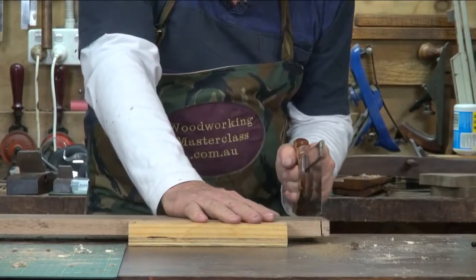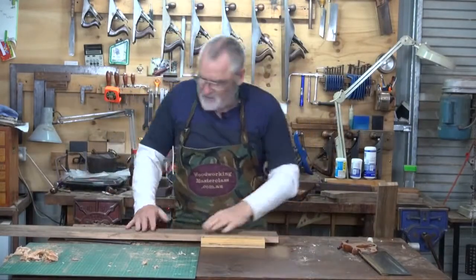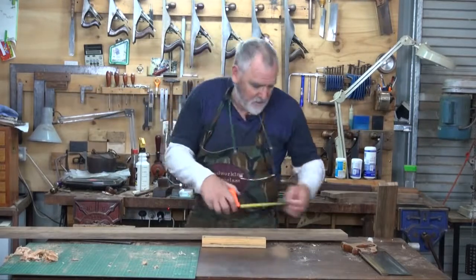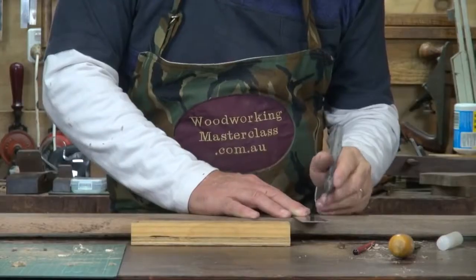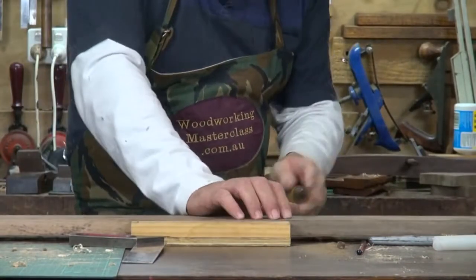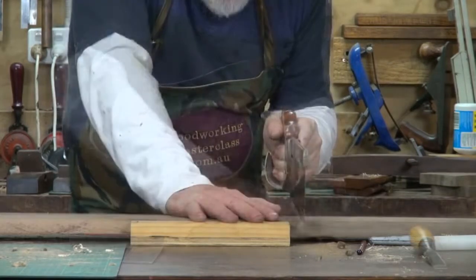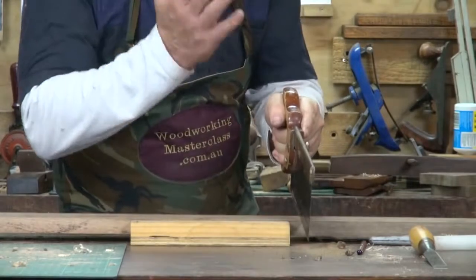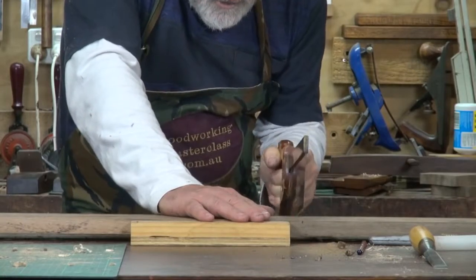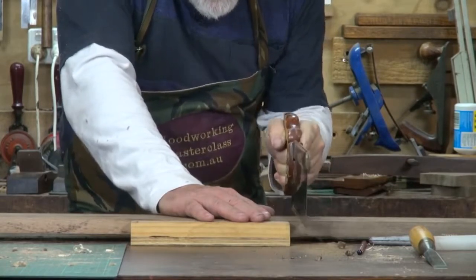Just join those two cut lines up. And there we have it. This is the saddle measured at 920. I lead in with the saw on the front, and then gradually bring it back so I'm getting an even cut all the way along. Then lean it at the back. Now I'm fine.